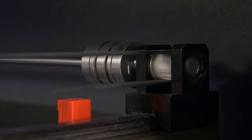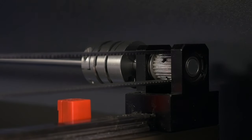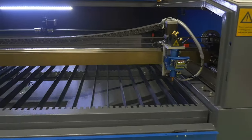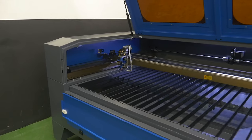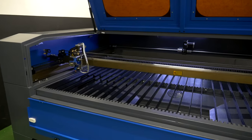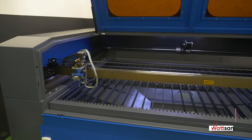The FOTEC end sensors with an actuation distance of 5 millimeters are used to prevent any collision of gantry elements with each other. Unlike mechanical ones, inductive sensors are less likely to fail as they are not susceptible to contamination and are designed for a longer service life.